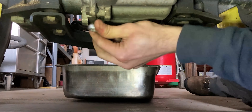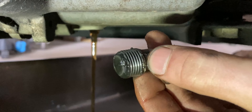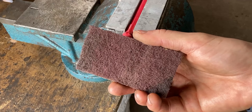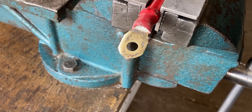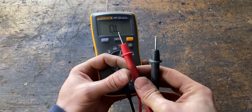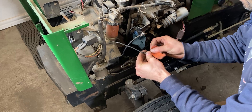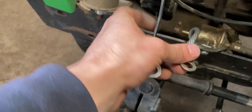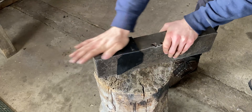While the hydraulic oil is draining I'll get to those battery cables. I usually clean them up with a brass brush, Scotch-Brite, and emery cloth. After that I grab my multimeter, set it to the ohm setting to check for resistance — the multimeter tests good. Now I'll clean the wires on the tractor the exact same way so I have proper ground and 12 volts to the starter. And I can't forget about that bent bracket underneath the tractor — let me straighten that out real quick.